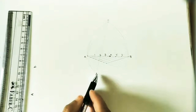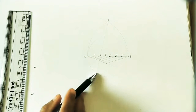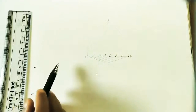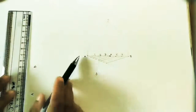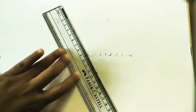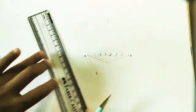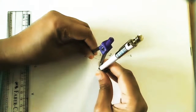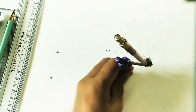The length A to D is one of the side lengths of the heptagon. Take this length and cut the circle into 7 equal divisions using the AD length. Join A and D — this is one side of the heptagon. Take this radius and cut the circle into the remaining divisions.